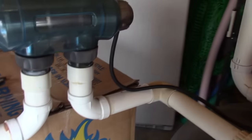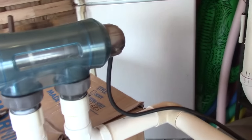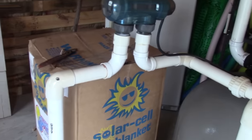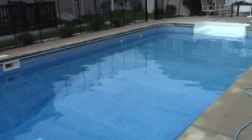For my saltwater generator, I usually loosen up the fittings just a half a turn in case there's any freezing — particularly on the back end. This little cup I like to take off as well. And the last thing I need to do is pull my safety cover, so we'll go ahead and get some help and get that pulled.